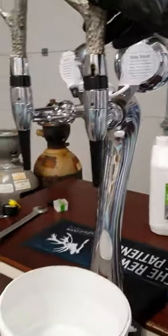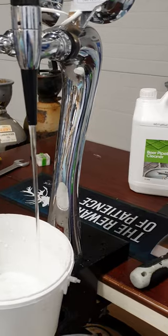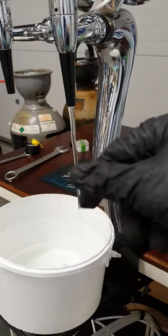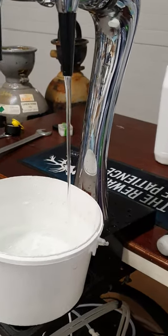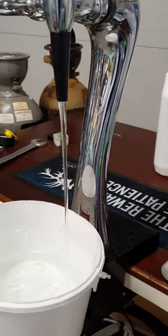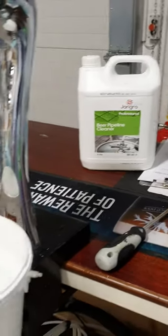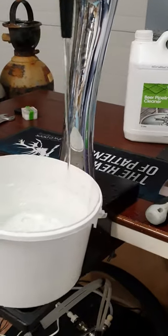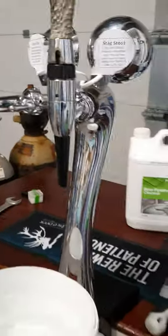It uses a bit of gas but a clean system is one of the most important things you can do at home. Tap all the way down — don't be rubbing it to try and tell when the water is coming through, just run five litres through it and you know it's done. Wear some eye protection when doing this — it's a chlorine-based alkaline cleaner with quite a high pH. That's how to clean your system.